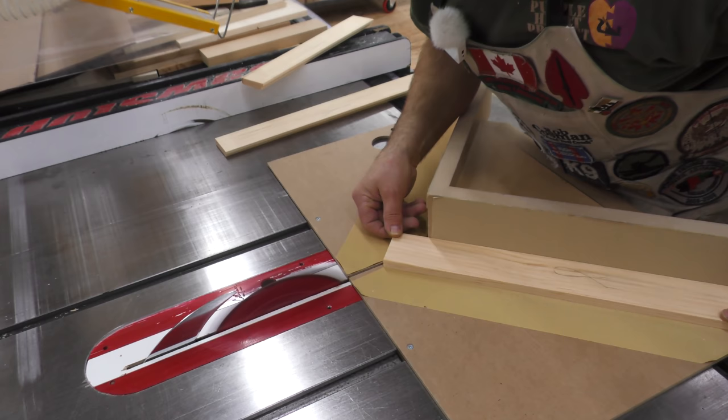All right, I think what I'll do is go in, take it apart, and I'll take just a little bit off of there. It means we've got to go through and do this all again, but we want it perfect. It takes a little bit of time. Okay. So we want to take just a sliver off of there. So what I'm going to do is use a shim. That's 26 thou. Just going to see how much of a gap that produces.